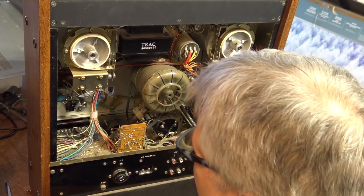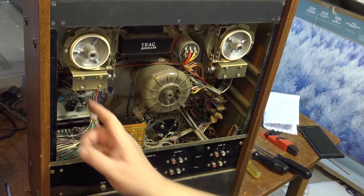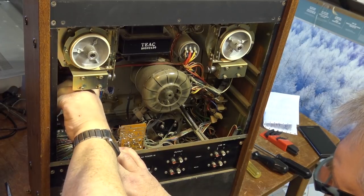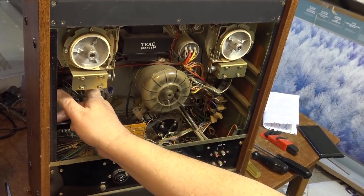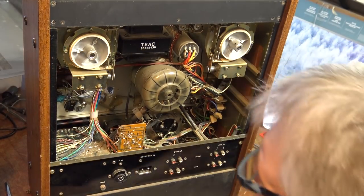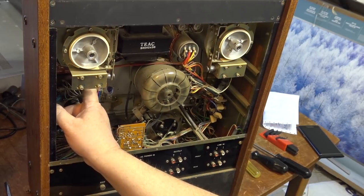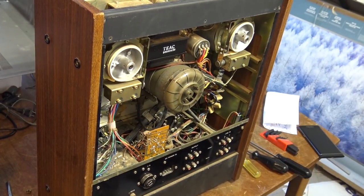I might not even have to remove this completely, as I've been able to get some oil in here and now get the pinch roller moving freely, as you can see. So I might not even have to take this down any further than this. I think I got this free enough. I was just able to get some oil into the bearing here, work its way along. I had my head in the way, so I can't show you how I was doing it, but this is nice and free now. So I think I dodged a bullet,